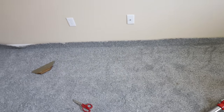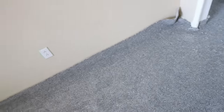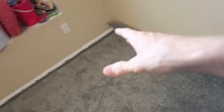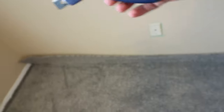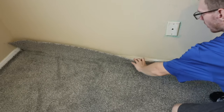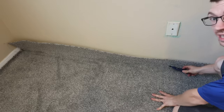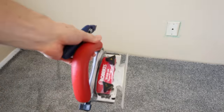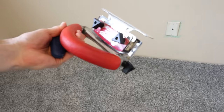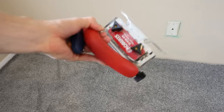At this point, everything is stretched around this room. All I have left to do is pretty much just trim everything — a couple of corners I've got to touch up. At this point, if all you have is your razor blade knife, you have to be very, very careful in order to trim. I recommend peeling it back and cutting it like this. You can cut it the other way, but you risk damaging your baseboard behind it. That's why, if at all possible, I definitely recommend getting one of these carpet cutters — they're not super cheap, but if you're going to be doing more than one room, I would definitely recommend it. It'll save you a lot of time.